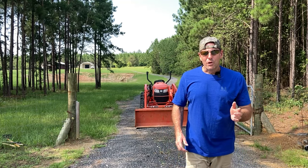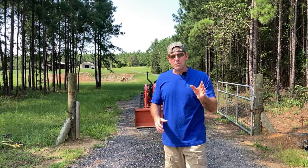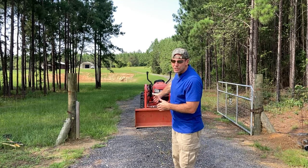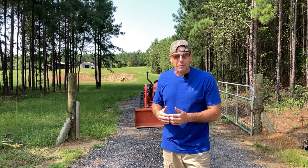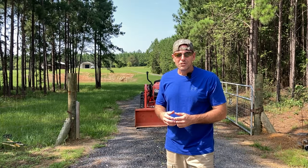Today's video, we're going to try and fix an erosion problem. What we have is water that comes from behind the camera where the paved road is and comes down our asphalt millings driveway and washes some of the millings into the grass area there. So we want to shore up that bank with some railroad ties and then backfill it with some extra millings that I have and hopefully get this where it doesn't wash out anymore. So that's what we're up to today.